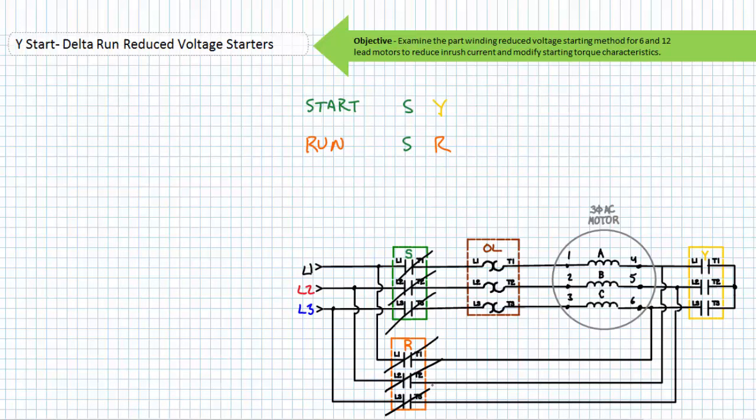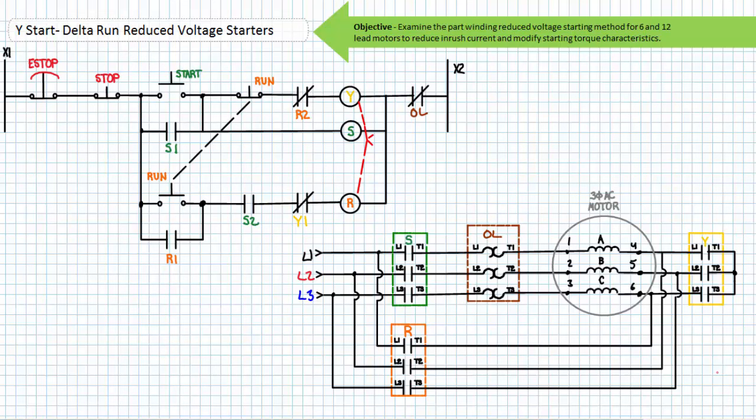This open transition can cause transient spikes whose magnitude is proportional to the degree of imbalance between the running motor and the primary voltage. Such disturbances can affect the supply and sensitive electrical equipment in the vicinity. Still, the staged reconfiguration of the motor windings yields less inrush and mechanical stress than a regular full-voltage motor starter, even when the transient spike is taken into consideration. Note the motor connection diagram must be adhered to such that both Y and delta configurations produce the same direction of rotation; if the delta configuration produced an opposite rotation, the motor would be plugged in reverse.